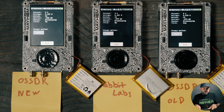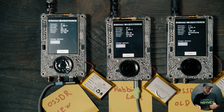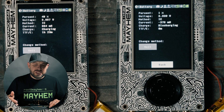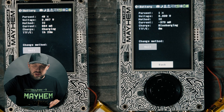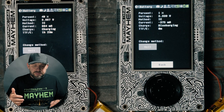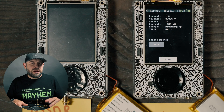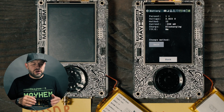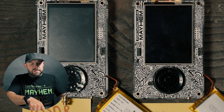I'll show an overlay of these three devices draining and then shutting off. Full disclosure — these two devices with the two new batteries shut off first. This one is still draining. I already have those two recharging. The draining is not good on the old one, because you can see we are still at 1%, drawing 3.339 volts, and the current is at negative 0.79 milliamps — it's still discharging. The shutoff on the two newer ones was roughly 3.6 volts and they were very neck and neck on discharge rate. I started these at 5% battery left and they still went an additional maybe 20 minutes before each shut off.